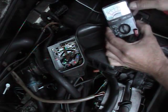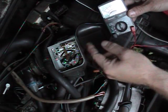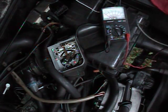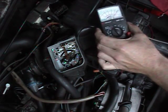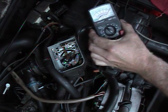This isn't that accurate, but it is the analog kind, which shows the sweep of the arc real well. I don't have my digital out here, so I'm going to set it to ohms — adjusted for 1,000 ohms. Then I'm going to test the multimeter: put these things in the probe, this should go to zero. There's an adjustment dial on here, so I'm going to dial that in so it's right at zero.